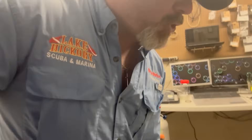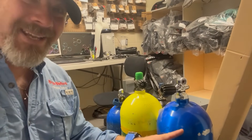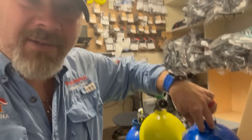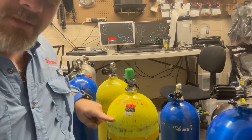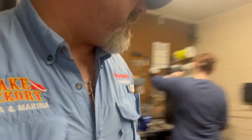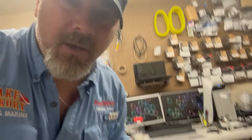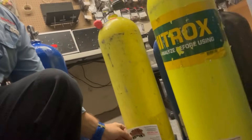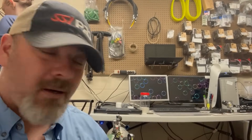Please: one visual inspection sticker per cylinder, and stop putting visual inspection stickers on the bottom of cylinders - that is not where they go. There are two main correct placements. One: around the crown area here, as long as it does not block any of the letters or numbers stamped there. Two: on the side wall - we put ours on the back, lined up with the valve, straight down, right above the tank boot if there is one, or near the bottom of the side wall if there isn't.